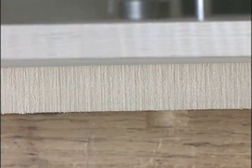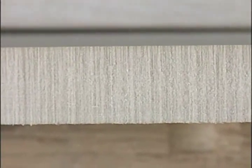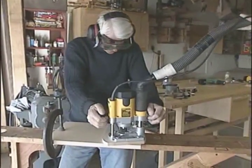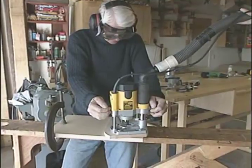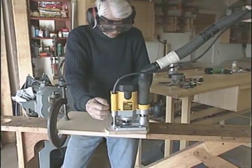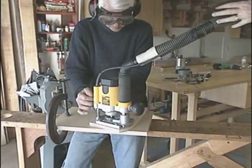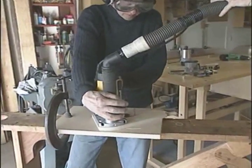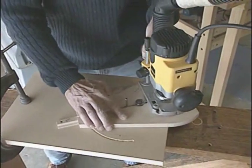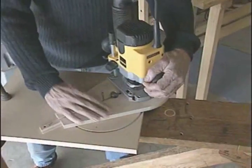My template stock is MDF. I like the material because it wears so uniformly and because of its dimensional stability. The DeWalt tool has its own vacuum port for cleanup. My trusty assistant now will manage the hose for me. Set the depth of cut for a little less than half the thickness and cut from both sides in a few stages. When your cut puts the entire diameter of the bit into the stock, you should use solid carbide.